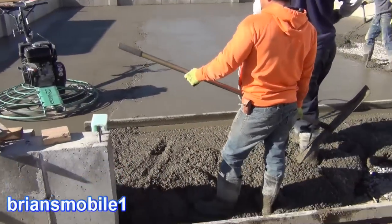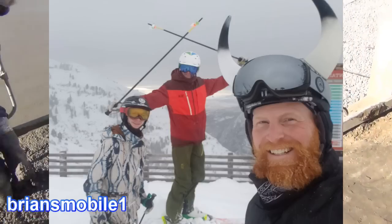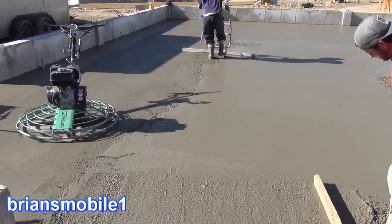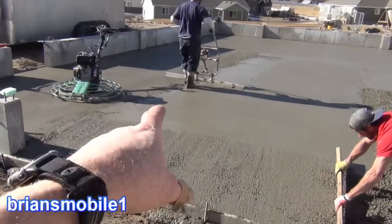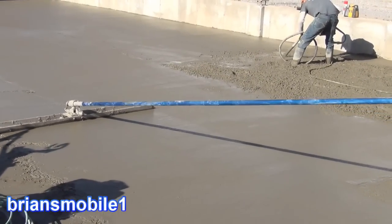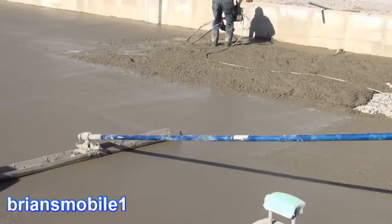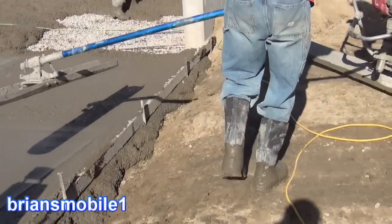Putting the board in now. We kept it out so we could drive trucks all the way in there. Brandon's a friend of mine — he didn't even call me out on what was going on; he just rolled with it and made it work. We watched this screed really fast and easy — now you just got to fight it and fight it and fight it. Way, way harder if you don't get one continuous pour. When you have an interruption in pour, it creates a joint that you have to un-joint through all this vibration and beating and settling. Really got to work to get it back.